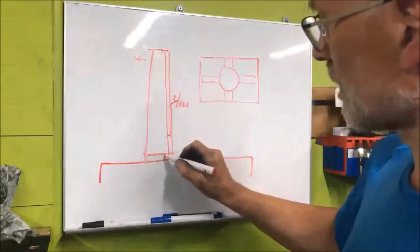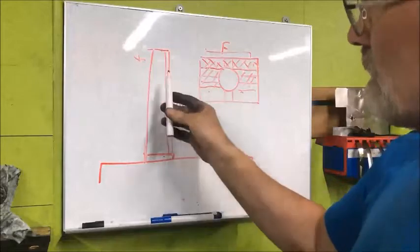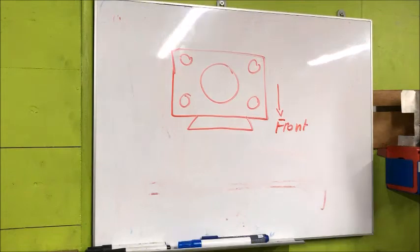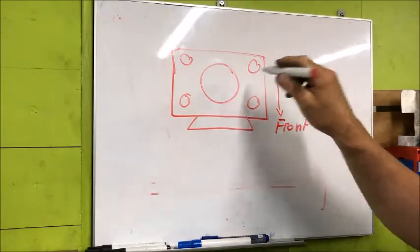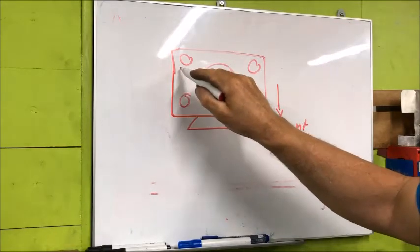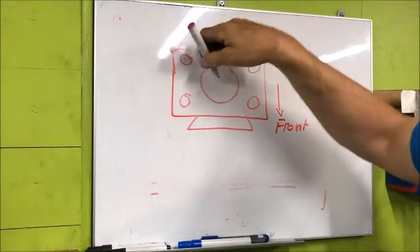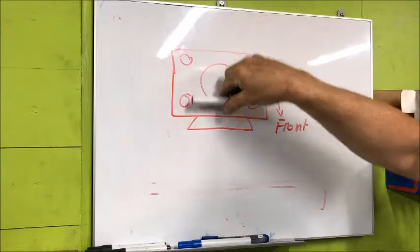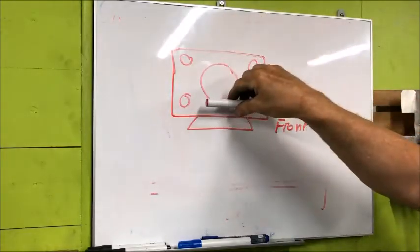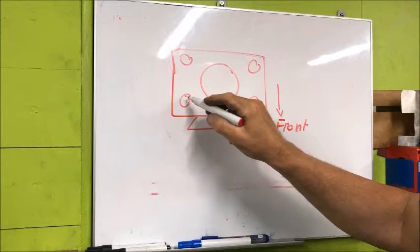So if I scrape harder here, I will tilt the column forwards. It was a little bit inward, and looking at the column from the bottom with the front here, I will step scrape it — meaning I will move it first in this direction, then in this direction. For the reverse tilt, I will take away material in the front most.